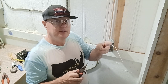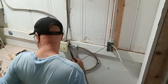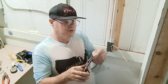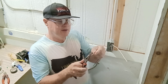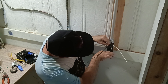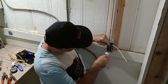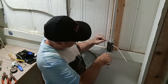We'll take our tail wires — one, two. I'm going to put the longer one on the box, so I'm going to make a loop in the direction our screw turns. We'll put it in the back of our box here and close our loop, direction the screw turns, nice and tight.